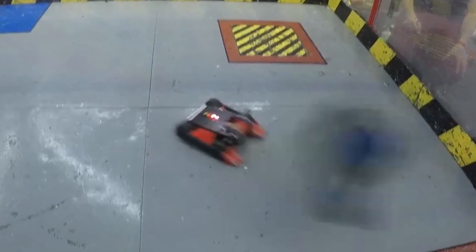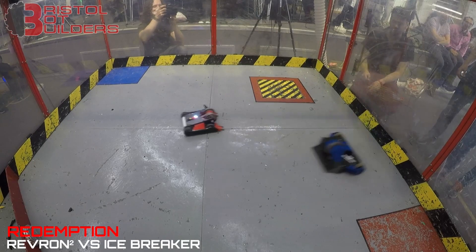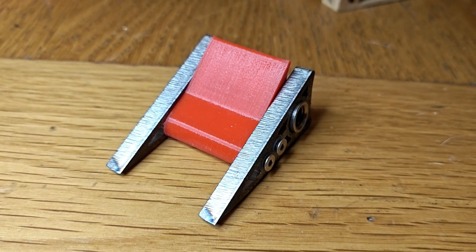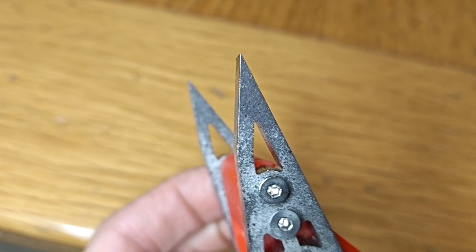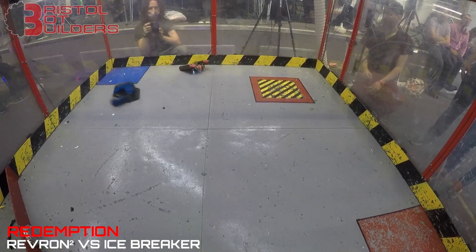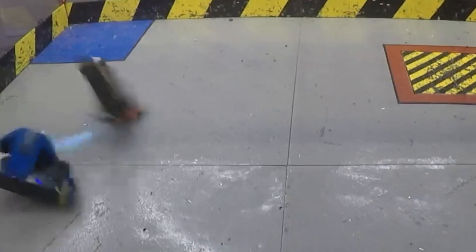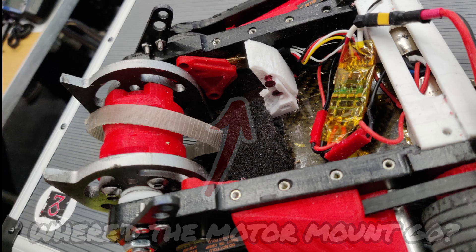Initially I was winning every interaction — the robot was roofing Icebreaker over and over. However another design flaw would show up. I had decided it would be better if the forks and wedgelets moved together, so I'd added standoffs between the two sets of forks and through the wedgelets. When they took a hit, the standoffs got bent and one fork was raised slightly — this small change was all it took to go from dominating the ground game to losing every head-on exchange. Going head-on also exposed the belt problem: when the belt took a direct hit and stopped dead, instead of snapping, it reeled the motor into the back of my weapon, doing a surprising amount of internal damage — worse than the belt just snapping in the first place.